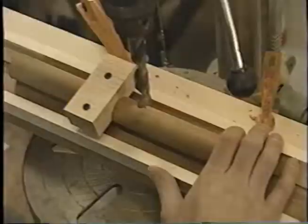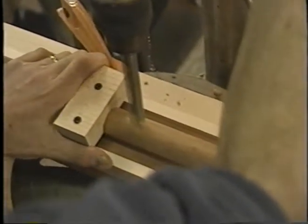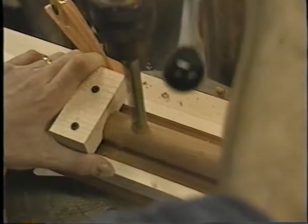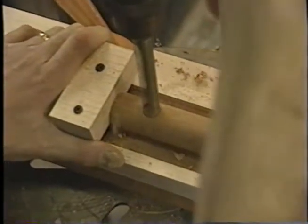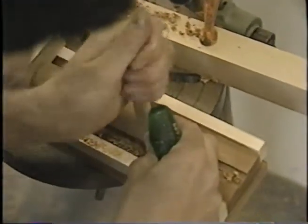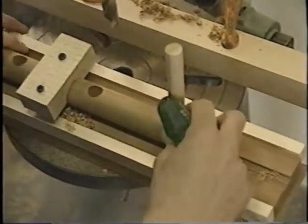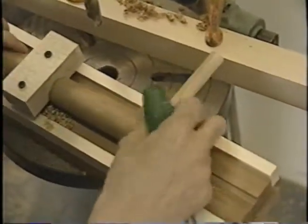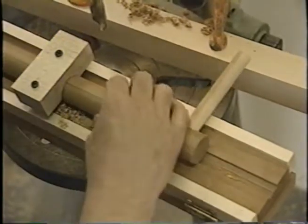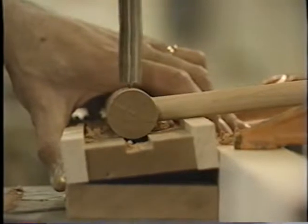Now here, I've skipped over showing you one little step. I've readjusted the fence to center the hole in this new tilted configuration. First, drill all the holes for the side rungs. I put in a scrap rung and rotate uphill. Because of the wedges, this time the rotation is 90 degrees minus 7, or 83 degrees. Then I drill for the front rungs.